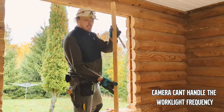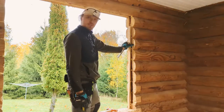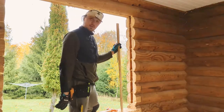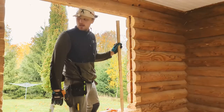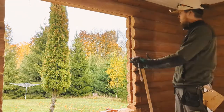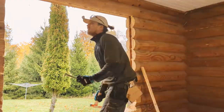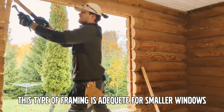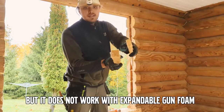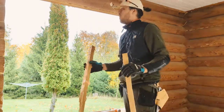There wasn't anything left of the post that was supposed to hold the wall straight. They pretty much just chainsaw-cut it thinner to make an opening for the window. I don't know if they didn't have tape measures or what the problem was, but they somehow managed to always cut one side really thin. This is not enough to hold the wall straight.